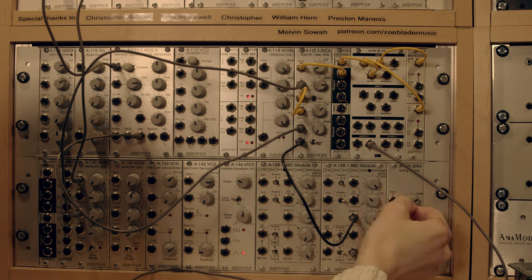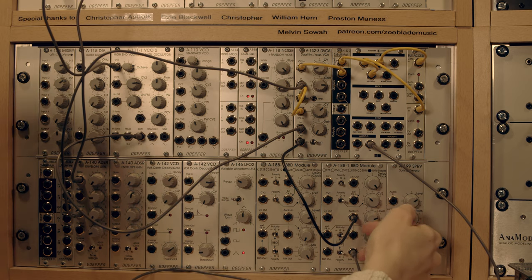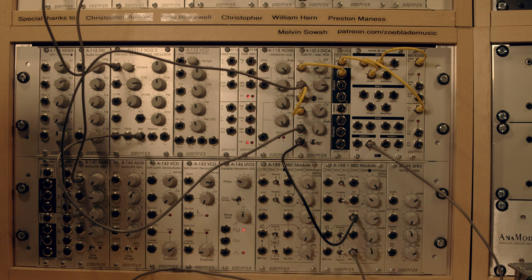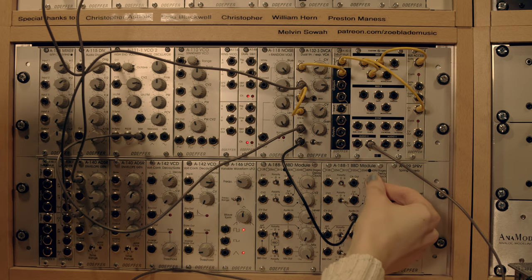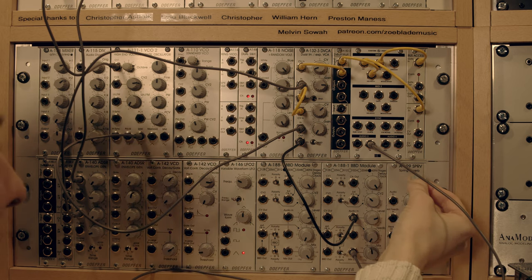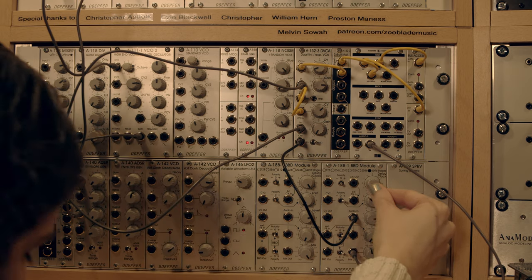First of all, there's a bit of a noise floor on here, which is probably the least of its issues, but just like with tape, there is a background hiss because, you know, it's not perfect. Everything has kind of entropy in the universe, and BBDs are not the best things in the world for high fidelity. So background noise is something you have to live with. Second thing to talk about is the sample rate, which makes it sound as if it's digital, which it really isn't, but it's kind of complicated.